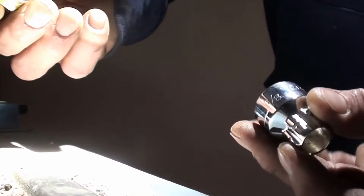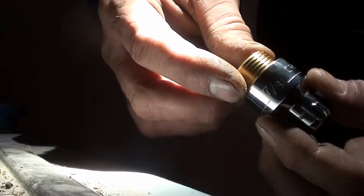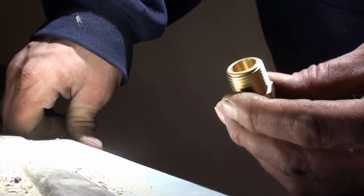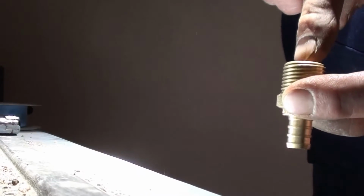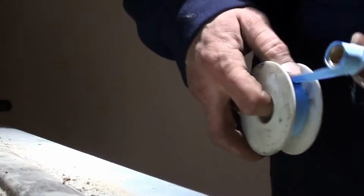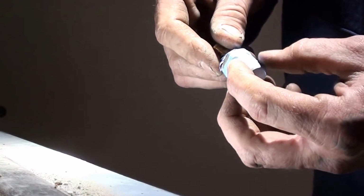So what I'm going to do to put these on up there so I don't have to fight with my channel locks is do that. Put it on in there, put some Teflon on it. Now remember, when you do your Teflon, so that it doesn't back off of the fitting when you're tightening it in, you have to hold it upright like that, look down into the threads, and wrap clockwise. Because if we put it on the other way, when we're tightening it down, it's going to unravel it off of there. So just a little tip, something to think about.